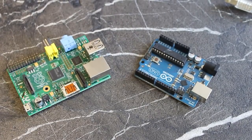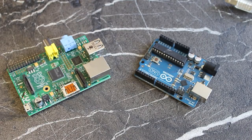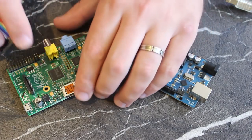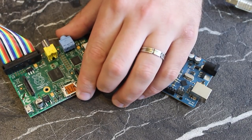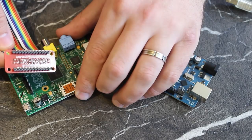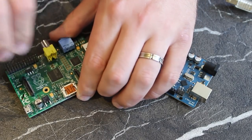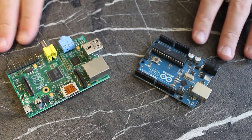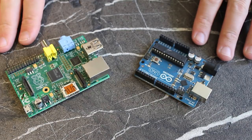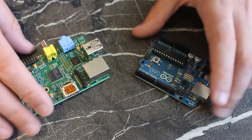Interestingly, there's also a set of GPIO pins, which stands for General Input and Output — equivalent to the digital IO pins of an Arduino. However, you need to be a lot more cautious when working with them because it's easier to overload the Pi and burn it out, and it operates on a non-standard 3.3 volts, unlike Arduino IO pins which are 5 volts. Since most sensors you'll come across want 5 volts, you'll need to use transistors, MOSFETs, or other electronics to modify a given circuit.